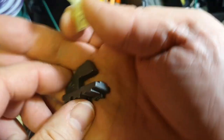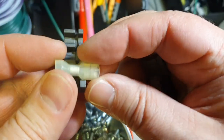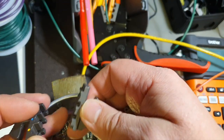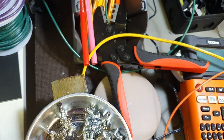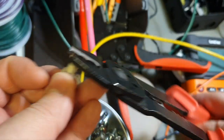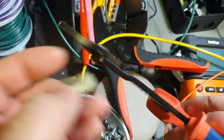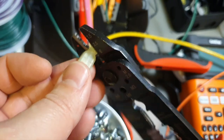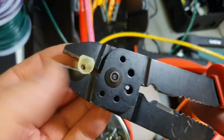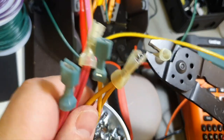However, if you try to crimp it with that tool, and you try to fit it, where is yellow here, you can't, no matter which one. And I don't want to buy a $300 to $700 TE tool. That's where you need to use the basic tool, that one also a kind of good one, not just thin Chinese junk. And you crimp it here, and that's what we will do now. That's the only option if you don't have a good tool. But anyway, as you have seen, in that case you don't crimp that part.